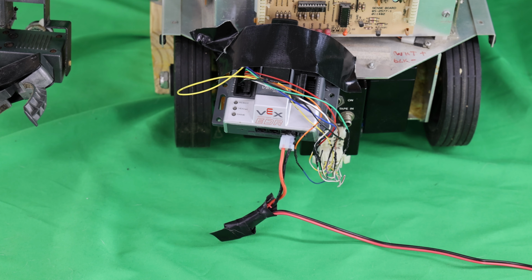What you do is you just remove all the previous boards and you carefully save them. So it's a non-destructive upgrade. You don't do any wiring changes or anything. In fact, you could even take a working one, although I would only do that if I was really confident of my skill levels. But then again, unplugging these boards and plugging them back in sometimes gets the boards working, because those contacts corrode over the years. So removing the boards and cleaning the contacts and then putting them back might get your robot working again. That's happened to me. I just removed the board, cleaned the contacts, pushed it back in carefully, and the thing worked. So the new kit is going to allow you to remove all the boards and carefully pack them away, so if you want to restore the robot to its original condition, you can.